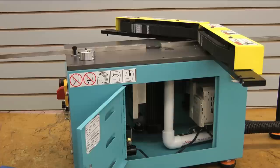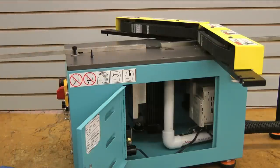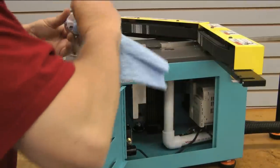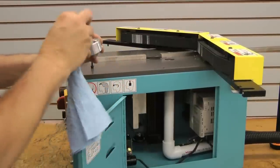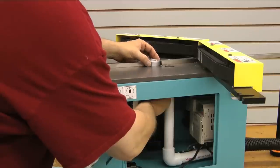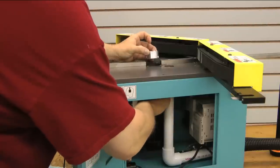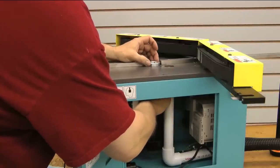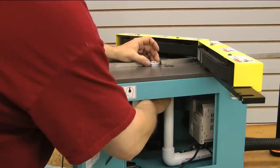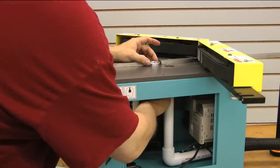The first thing we want to do when putting on the new cutter is take our cutter out and make sure that everything is clean. Make sure there are no chips or dirt on the inside of the taper. You want to be very careful never to touch the diamonds with the wrench or anything — it's a very sharp but brittle edge. Even though it's diamond, it's easy to curl over the edge because it's lapped to such a fine degree that any little nick could create a dull finish for you. So you want to be very careful around your diamond.